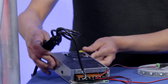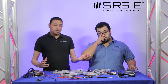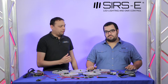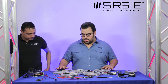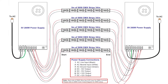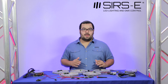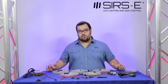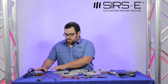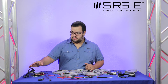We want to show exactly how it came to this point, so I'm going to have Jorge show you exactly what items you see on this table and explain how to connect a series of these wire sets. Our setup is a quick DMX setup — we have five LED DMX strips and two power supplies. The main reason is so each power supply can power up both ends of the DMX strip, helping you avoid voltage drop and get a more balanced light output throughout your strip.